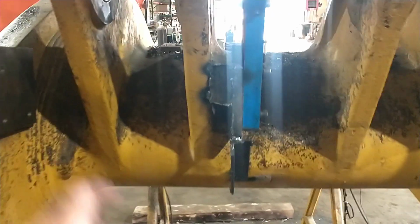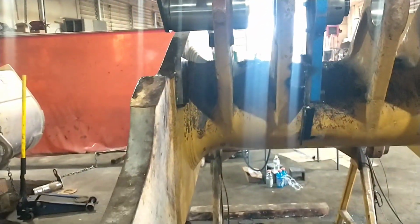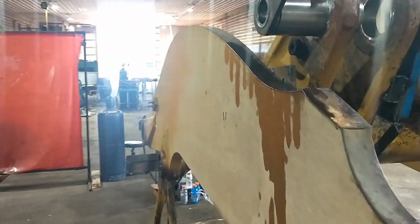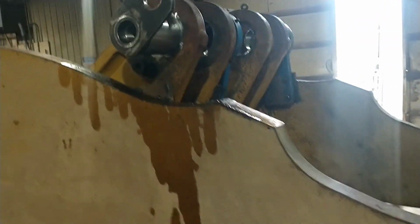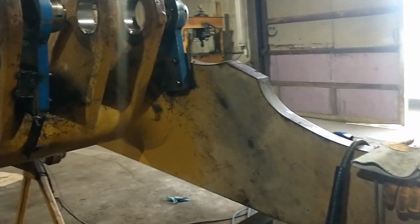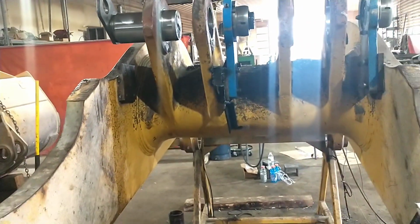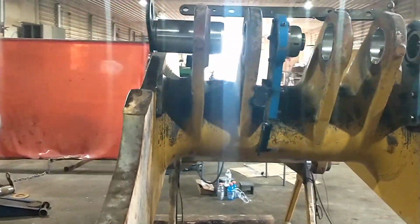I was floored. So with me having my 5/1000ths here on a 5-inch pin, which is substantially bigger than 100 millimeters, I'm still way at the tight end of JRB's tolerances. Anyway, that was just an interesting discovery. So we're gonna get this thing wrapped up, press some bushings in the rest of the holes, and get out of here so we can get some other work done.